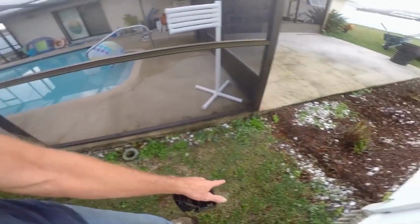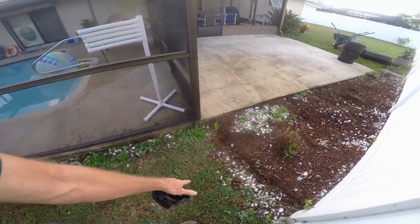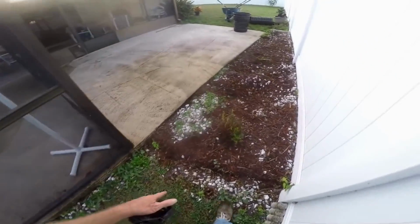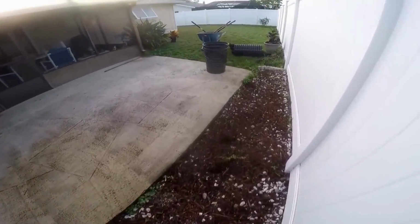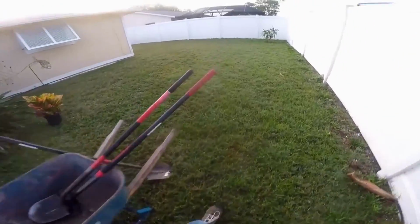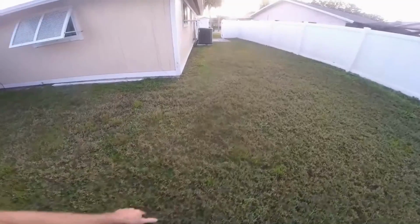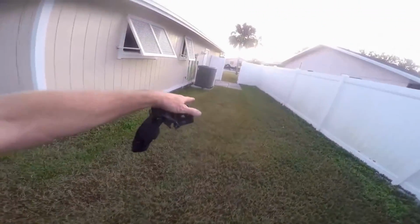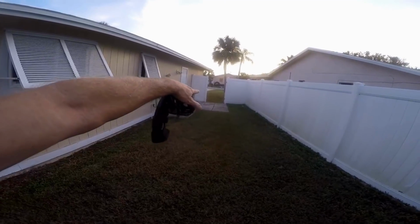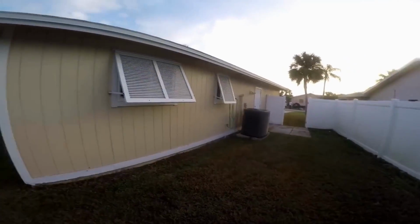We're going to put a sump pump over here because this is Florida and it's very, very flat to send things out to the street. So we're going to actually lift the water up. It'll come all the way around. Very typical, a long discharge, but the good Zoller M53 will easily push this water around, and of course it's going to go out to the front yard. We're not going to go all the way to the street because there is fall after you get past the fence. It starts to go downhill over there.